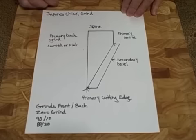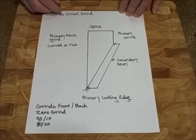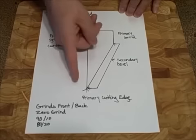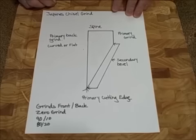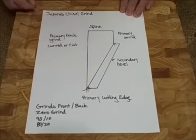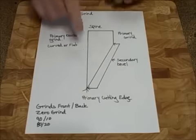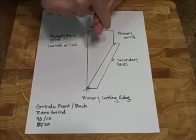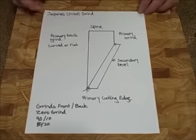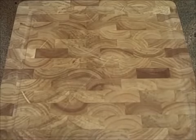In some cases, these knives can come lightly beveled at around 90-10 or 80-20, but a truly traditional Japanese knife will be a zero grind. As you work it on the stone on both sides, it will take that very fine primary cutting edge and work it to a zero point where there's no secondary grind — very effective, and for some, very difficult to maintain.